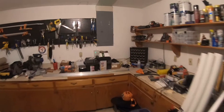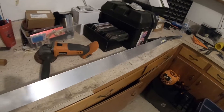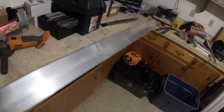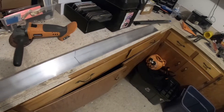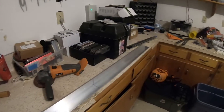We're going to build some brackets out of angle aluminum. This is a two-by-two piece of aluminum I got down at Tractor Supply - you can get this at pretty much any big-box home goods store. I'll just measure out the pieces, cut it, and drill some holes to mount it down to the floor and attach the rails.